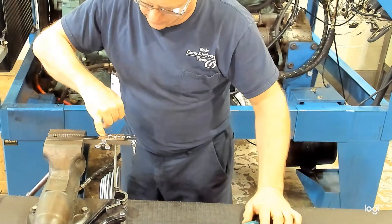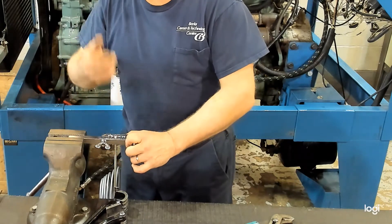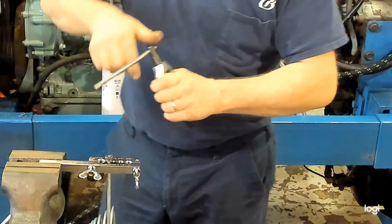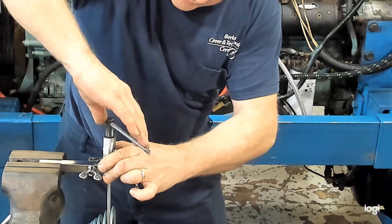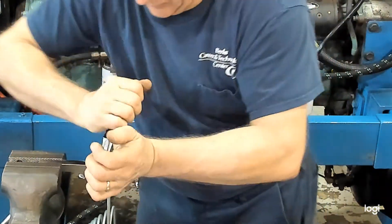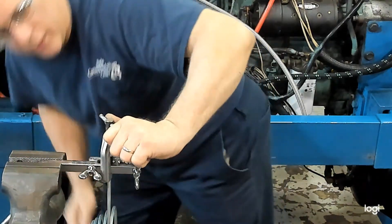We're looking to see there's no gap on either side pinching the tubing. If you leave it loose in any way it will just push the tubing straight down through and we won't get the proper flare, because we're using the height. Take the button — next step — put the pin end into the tubing, make sure you have the proper size. Take the pressure tool, slide it over, and unscrew until it slides over the button. Square it up, make sure the button is squared, and then we're going to simply tighten this down by hand with moderate pressure. You'll see the button just about touch the top of the split yoke.